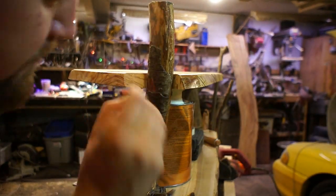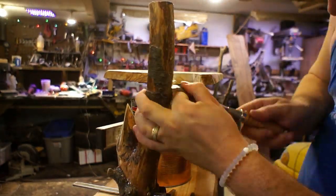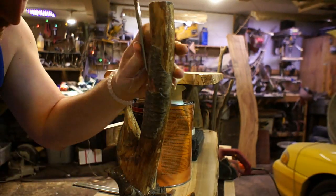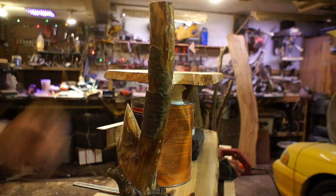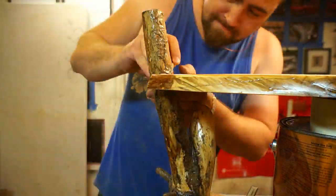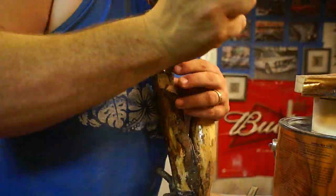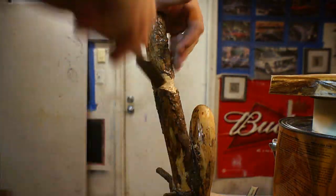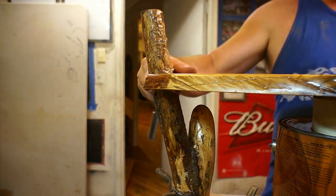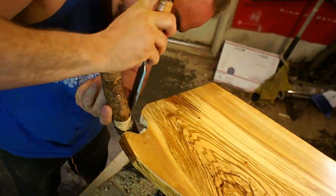Using tree branches means nothing is at an exact right angle, so I had to deal with a lot of weird, funny intersecting angles and just had to do it by eye. I'd put it up there, test fit it, carve into it a little bit, and fit it again. I'm making a little shelf in there so it's stronger — carving down to make a flat piece for it to rest on. On the right side I stacked up a paint can and some tape just to keep it level and make sure I'm hitting it at the exact right spot.